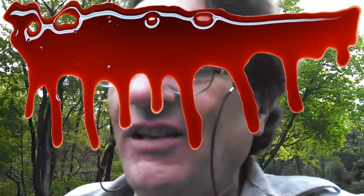Before I forget, and I'm going to tell you this in this video and any other video where I'm up on a roof and I remember to tell you: never walk backwards on a roof, all right? The reason is you don't want to start walking backwards and fall off the roof. That fall ain't going to kill you, okay? But it's going to give you stuff like compound fractures, a broken back, paralysis from the waist down, or a broken neck, quadriplegic for the rest of your life. That's the trouble with ladders and roofs: you don't just get hurt, you get messed up badly. So you want to get in the habit of never walking backwards,